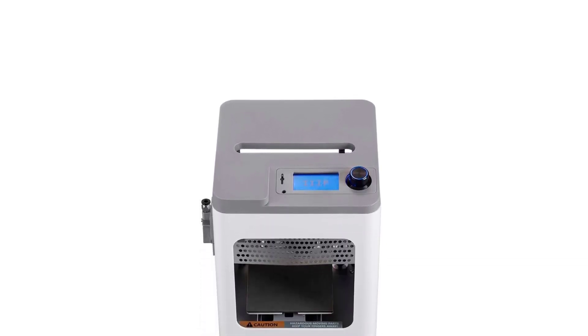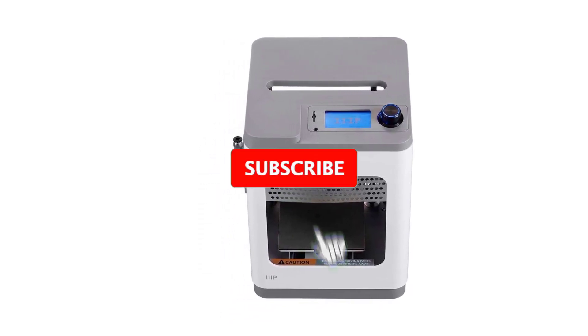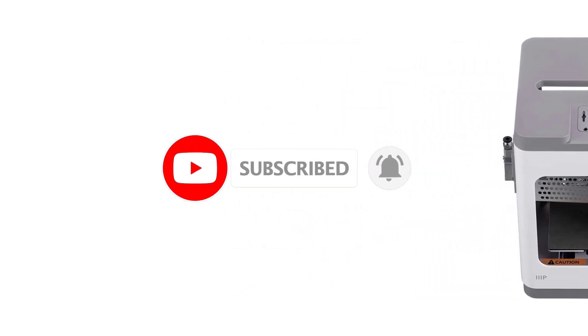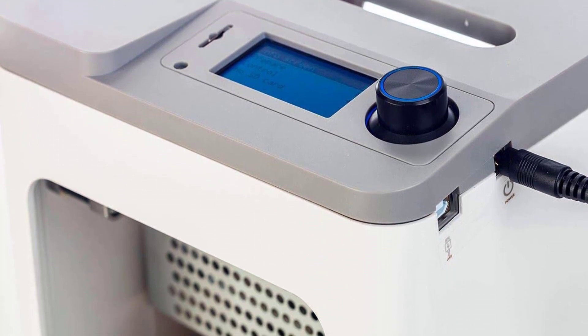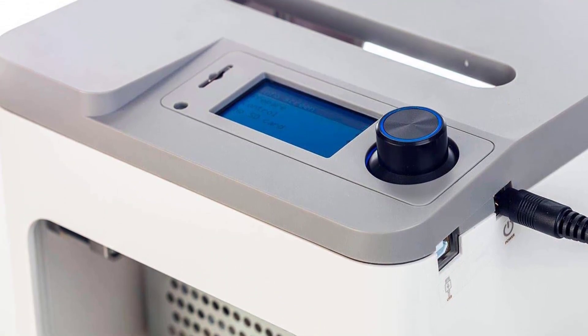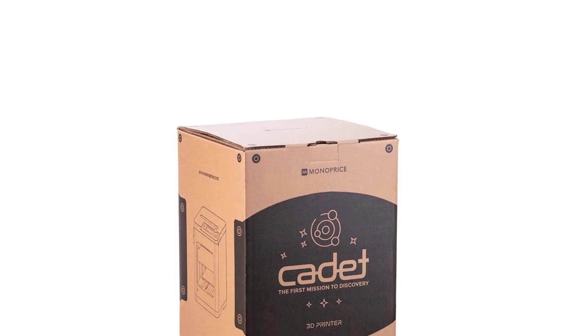However, this machine lacks the relatively advanced features you get from more expensive printers, such as the Prusa Mini Plus and i3 MK3s Plus. Among the 8 test prints we attempted, the MP Cadet produced 4 great-looking prints, 1 mediocre print, and 3 failures. The MP Cadet can print layers as thin as 0.4mm — 8 times thicker than the MK3s Plus's 0.05mm layers — but still thin enough that prints look tidy, even if you can see each individual layer. It did a mediocre job printing the skull lamp file, which has lots of small details and overhangs.